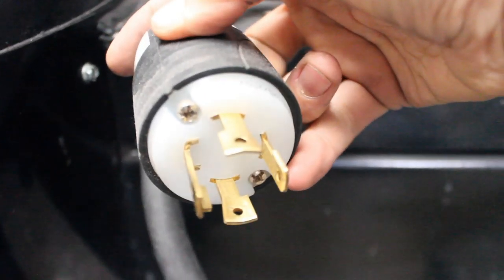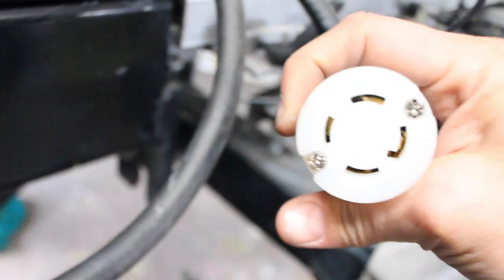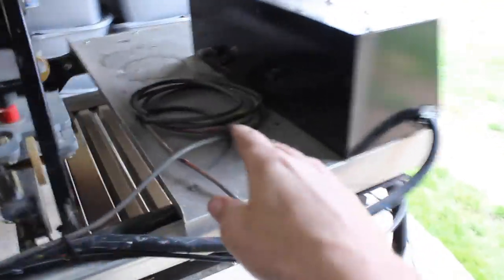There's this cable that runs down the center, and we have an additional cable coming from this flash here, so it kind of just runs over the top of the press. You just have it routed and then it plugs in right here into flash number one. I'm just going to disconnect this. There's also an air hose that connects to each of the flashes — this air hose here runs to a T, and each one of those are tied into it.